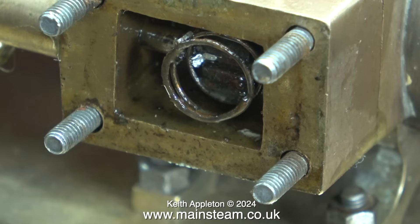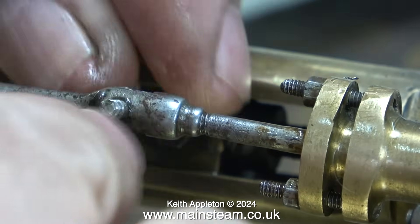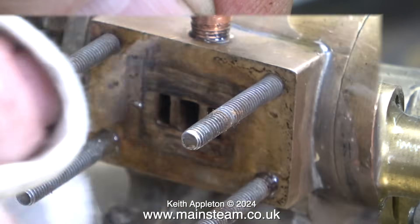As with most subjects, it's a good idea to know something about what you're working with. I've been playing with steam engines most of my life and fully understand how they work. There's a standard bolt which drives the valve — I will replace that with a proper pin, as the outer edges of a thread on a bolt are less than perfect as a bearing surface.